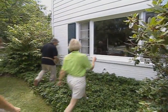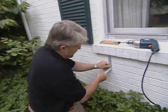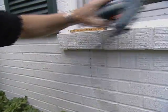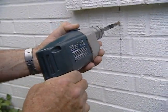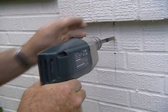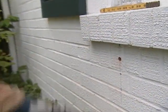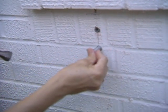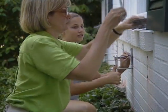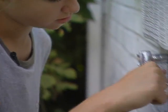Let's attach this planter to the wall now. We're going to use angle brackets, mounted in this direction. First we drill some holes — I've got a half-inch carbide-tipped bit in a hammer drill, which looks like a drill but hammers as it turns, making the drilling go a lot faster. This is called a lag shield, or sometimes an anchor — it's made of lead and goes right into the hole we just drilled. Just tap it in with a hammer. The L brackets are held in place with two-inch long lag screws; using a socket wrench, Karen and Mandy tighten them snugly.